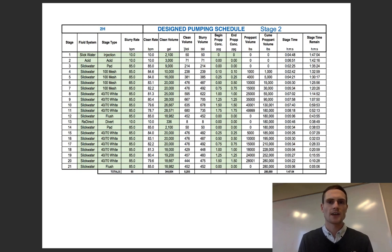They're pumping 214 barrels at roughly 85 barrels a minute during the pad, lasting about two and a half minutes, and then they're going to start pumping sand. Whenever you start pumping sand, you begin with your smaller grain size — typically in shale plays that's 100 mesh. This is a typical slick water design, about a year to a year and a half old. You're going to start with 100 mesh and try to keep your rate constant — 85 barrels a minute throughout the entire treatment — so you can monitor pressure and avoid screening out the well.